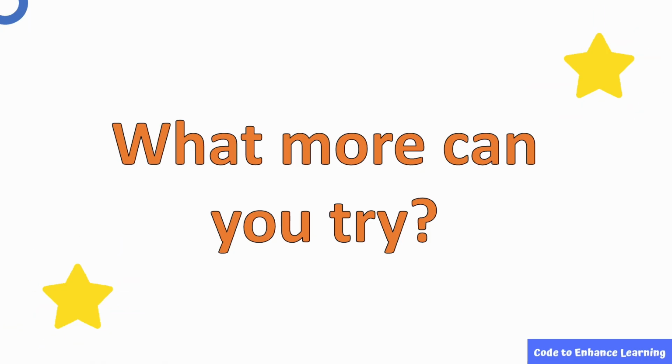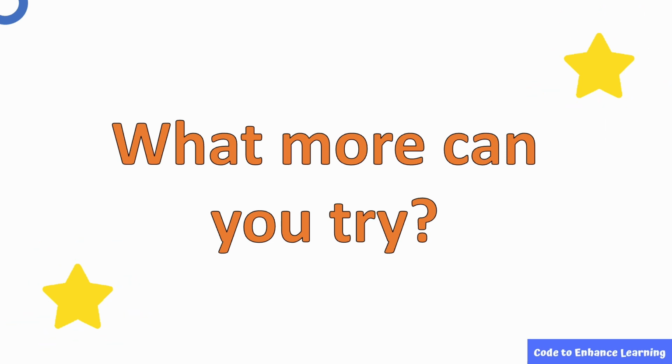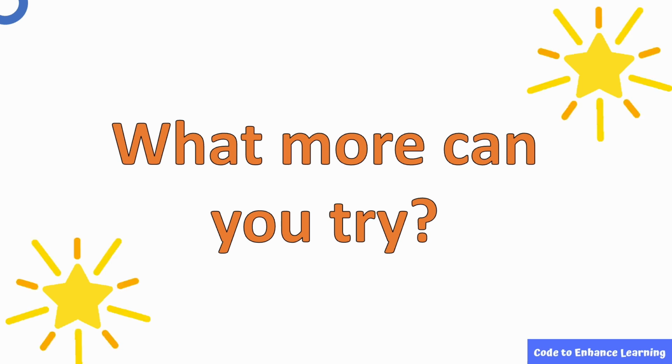Can you think of ways to bring more precision to our project? One way is to reduce the wait time to capture the distance. We currently have 0.25 seconds. Can you try with 0.01 seconds? Will it make it more precise? Think about it and also try experimenting with different wait times and different objects to see how your project reacts.